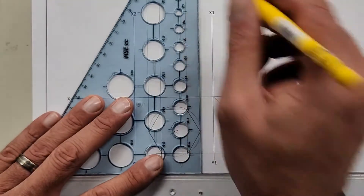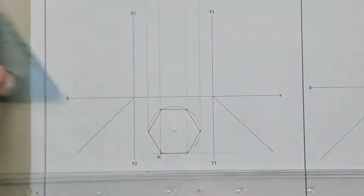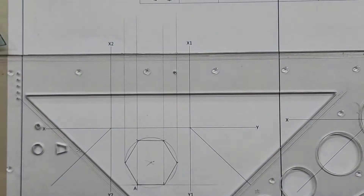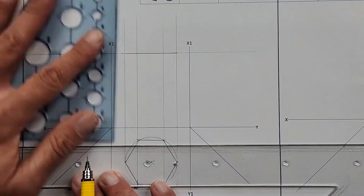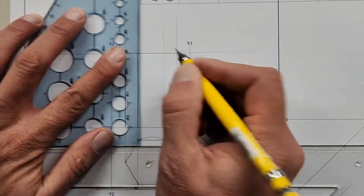The height from the XY is 60, so no worries, no stress, no anxiety — just with confidence. I already know I'm going to have to project a left view and right view, so I draw that construction line all the way through. The front is given so that's not going to be too difficult — draw that in.